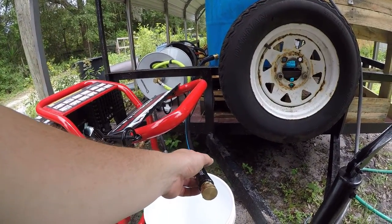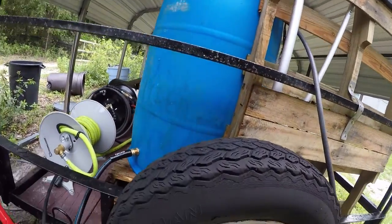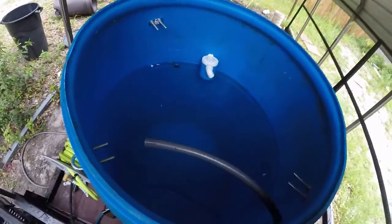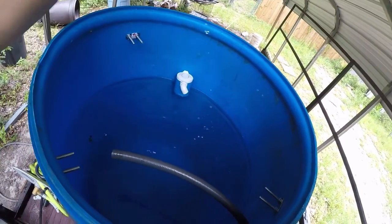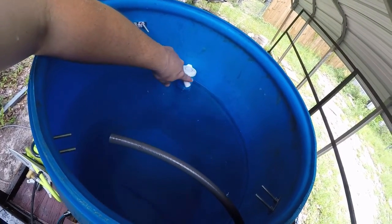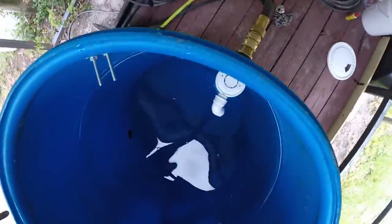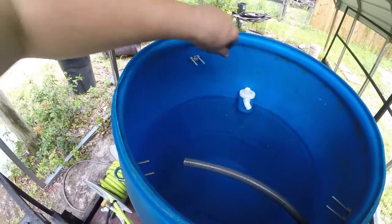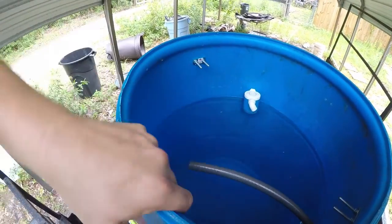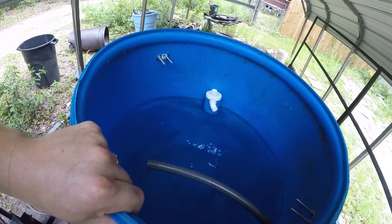Here's my buffer tank — it's totally full of water, right up to that valve. See what happens when you run without a lid? I gotta get a lid on this. Anyway, see that valve right there? That's the Hudson float valve. That's where my garden hose is hooked up — it shuts off automatically. If I shake this around you can see it's trying to squirt. It'll keep the tank full.